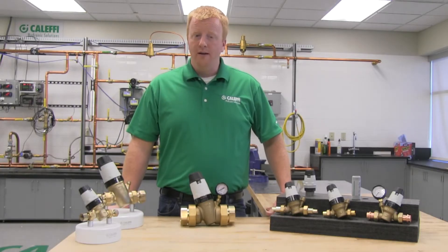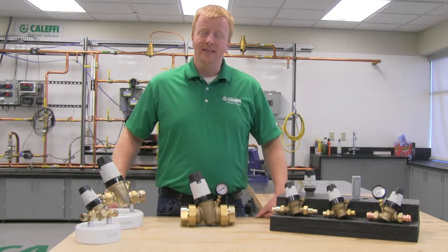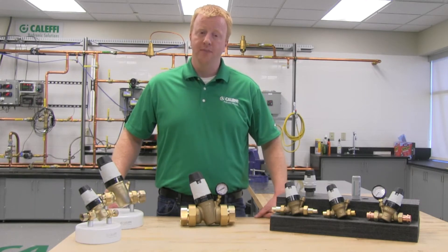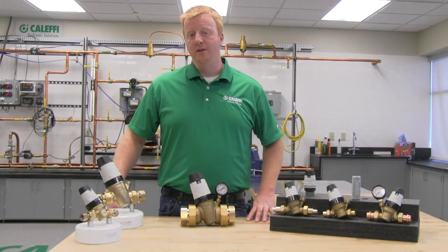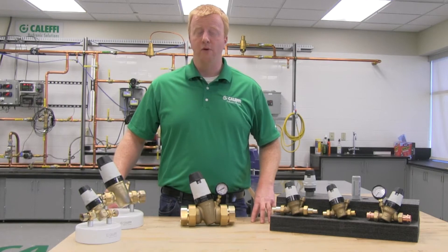The valve is a very high quality product. The body is made out of eco brass, which is a low lead DZR alloy that resists corrosion by hard water, chlorine, and oxygen. The internal moving parts are made out of stainless steel and a very durable low friction plastic material that resists the formation of lime scale, which is a common cause for PRV performance issues.